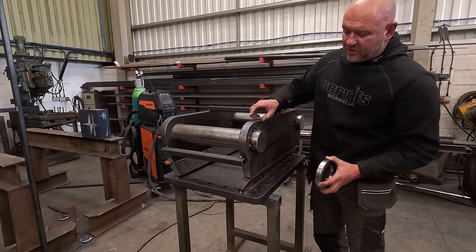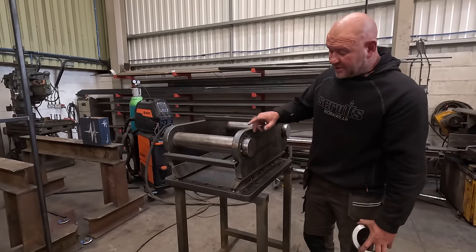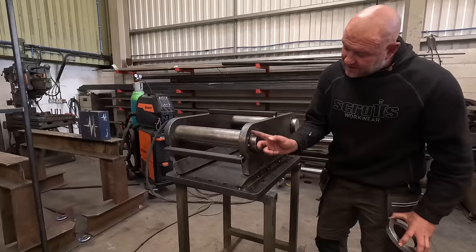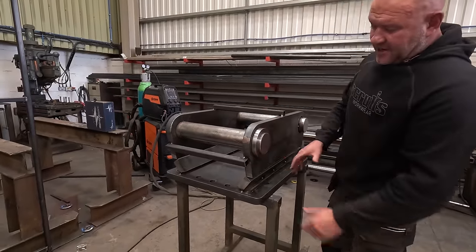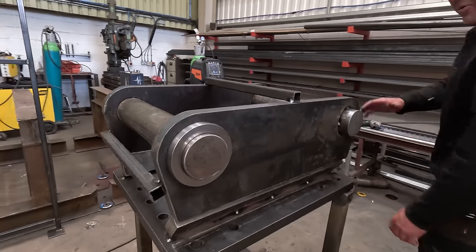A lot of cradles won't have that on, and buckets with ears on buckets, they don't have a collar like that, yeah? And they crack around there. So by putting that on, you're doubling it up on the welding and it'll never crack. So Callum will weld that up now.